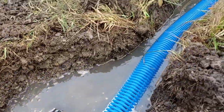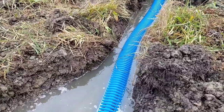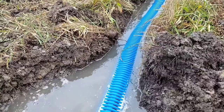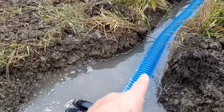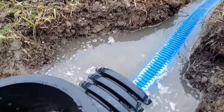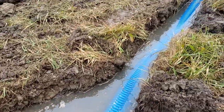It just turned on. Now, to my point, if the rain event stops and you have your float up to the high position, what do we end up with? This backfeeds. This backfeeds and holds water, and that is the problem. How do we prevent this? We go down one full foot deeper than our deepest trench.